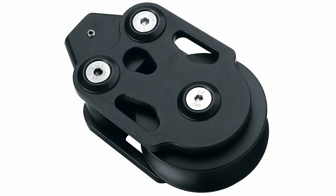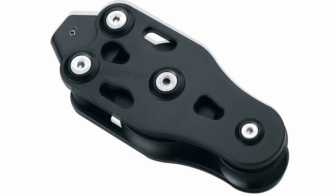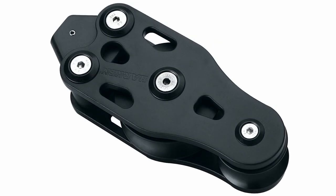We have come out with a range of blocks that work at the maximum load of each size cylinder they are designed to work with. There's a single block, a block with a becket, and a double block which looks more like a fiddle, but the strength of each sheave is comparable so that it can work like a double block would. Blocks are used on the ends of the rods to configure from a direct purchase, a reverse purchase one-to-two, all the way up to a one-to-four reverse.